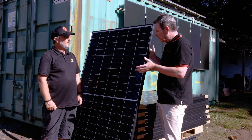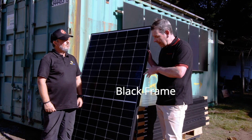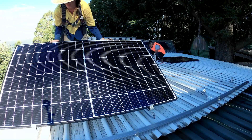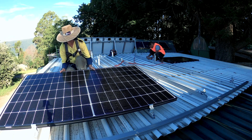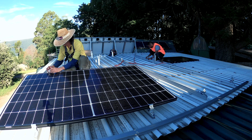So this is probably our standard residential module now — 370 watts, black frame, half-cut cells. There are some great advantages in terms of better shade tolerance. We've got multi-bus bar cells, so you've got a better ability to endure microfractures if, worst case scenario, they should occur.